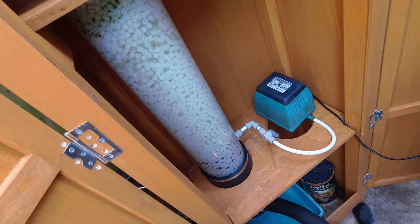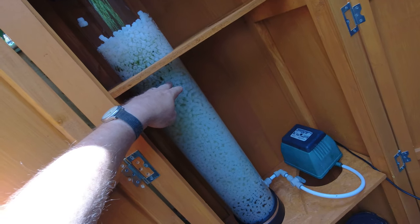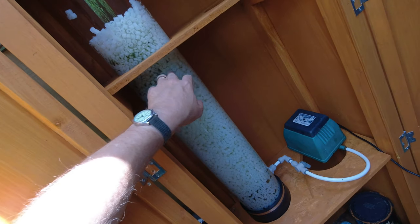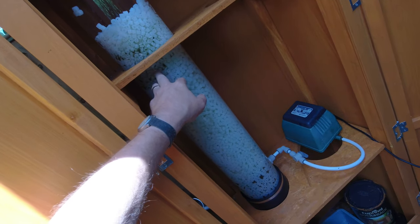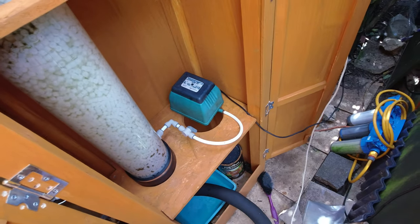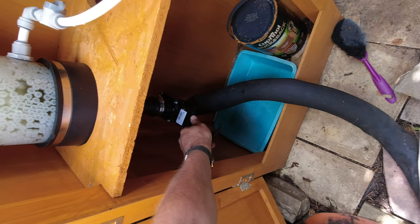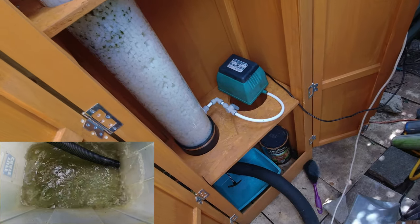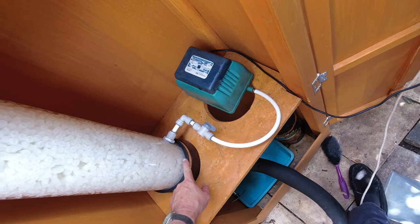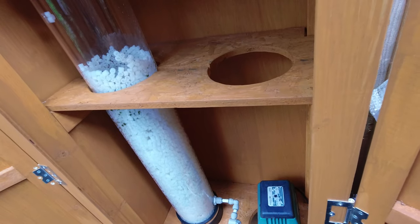Right, that's been bubbling away for about 10 minutes and you can see we've got nearly about 6 inches from the top. It might be that once this media matures it would all move in there, but I still think there's too much media — you can see there's still a lot sitting up here with dirt that hasn't moved. So right, as that's been boiling for a while, we'll now open the valve at the bottom and allow the water to drain — and that drained very quickly. Don't turn the valve off until the water's out otherwise you'll have water coming back through.